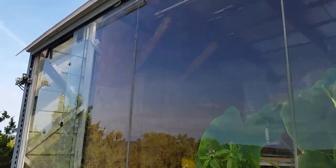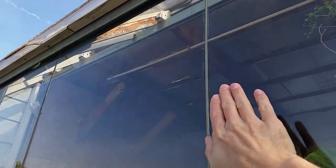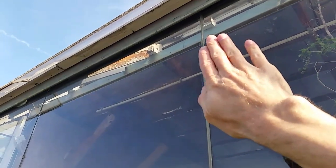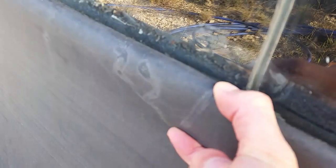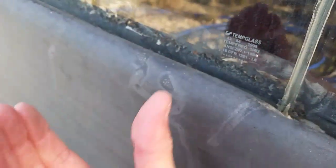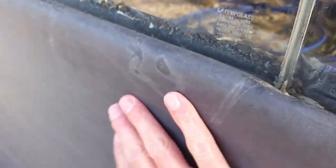Here is the glass on the outside. This Unistrut is like a letter C facing down. What I did was shove the glass up into it all the way — about three inches up — and then it moves down into this lower piece of Unistrut, which is only about one and a half inches deep. On the seam it has a nice little spot on both sides — like a letter C facing up. I put gym pad foam underneath this rubber, which is pond liner.